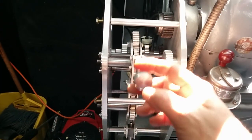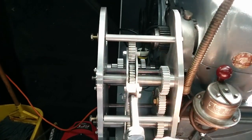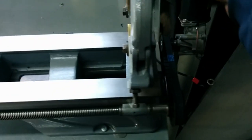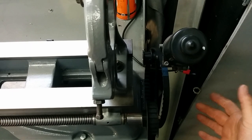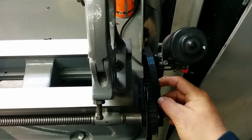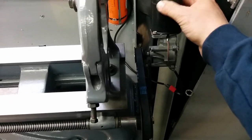The reason I have all this gearbox stuff is so I can do threading with pretty much an infinite amount of thread pitches. When I do want to thread, I just come back here, disengage the belt from the power feed motor, and then I can use the quick change gearbox just like I normally would.